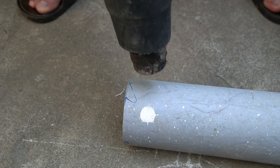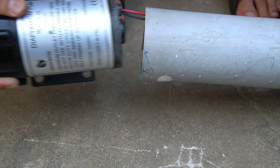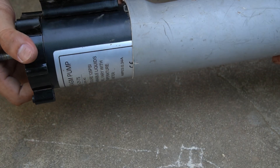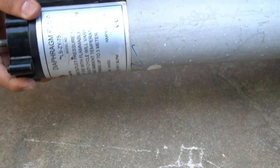I'm using a 76-millimeter PVC pipe to make the wind turbine blades. I'll heat the edge with a heat gun until it becomes soft, then flatten and shape it into smooth, aerodynamic blades. PVC is light and strong, perfect for capturing wind energy at home.